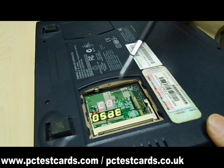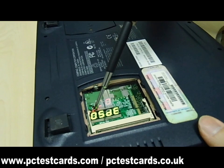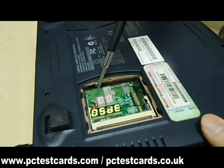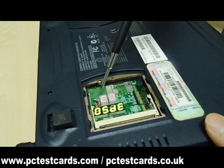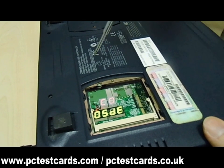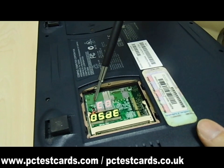We need to write these codes down. We also need to pay attention to the top left: there is a reset LED and a CLK clock LED. Right now, the CLK clock LED is steady on, but the reset LED never flashes at all. The reset LED should flash once or a couple of times when we press the laptop power button, but it never turns on. This indicates the laptop motherboard has a reset circuitry problem. To fix that, we need to repair the mobile chips. We should then interpret the BIOS code and factory code, which will likely confirm the reset circuitry problem.